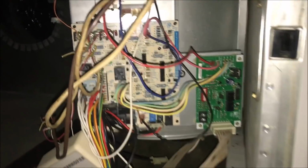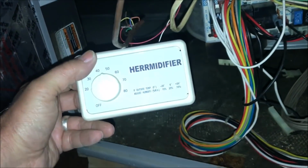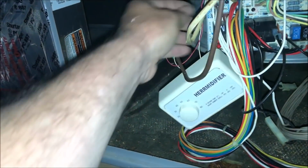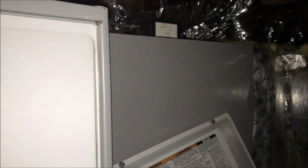All right. Still looks pretty clean in the plenum and all. A little bit of dust, and somebody has added this. That's definitely not mine. Huh. Got it right in the top of the coil. That's not a bad idea. If you're going to have that type that doesn't make steam, at least when you're just blowing water in the ductwork, you're catching some of it in the coil in the drain pan. I don't like those things there. All they do is just cause mold and mildew problems.